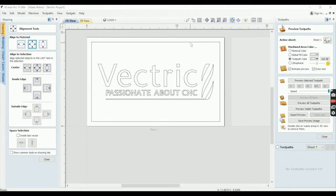And now you can see, if we cut this first, this pocket, we'll be able to fill that void with one color epoxy. Then we come back into the cured epoxy and cut this logo and pour that with whatever color we need to do there. And that is pretty much the gist of it. So let me show you how I'd set this up.